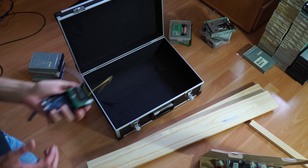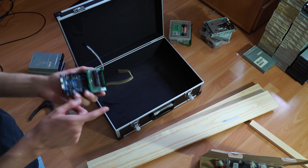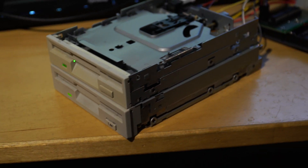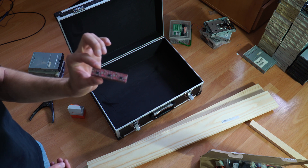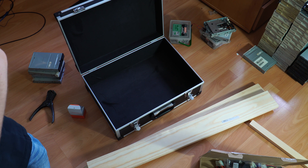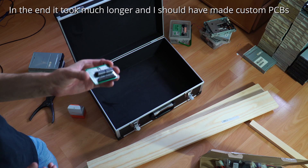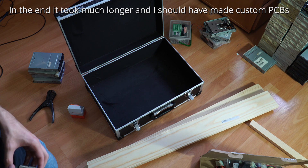Instead of using the old very thin cables, this time I bought a few standard Molex adapters and floppy Y cables. Another thing in this setup would be a new controller, which is an Arduino Due like in the old one, but this time with some shift registers which can control the enable pins of the drives as well. This means the drive will be turned off when it's not playing a note. This is not that important in the old setup, but it will be very important if you use not floppy drives but some normal stepper drivers with external big motors, so they are turned off and don't burn power all the time. For this I made two adapter boards — I wanted to make a custom PCB but didn't have the time, so I had to buy some standard perf board and shift registers locally, which was actually quite expensive but the only way to get it done quickly.